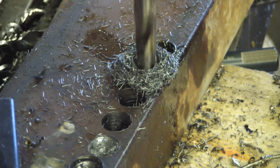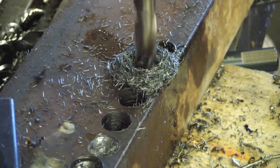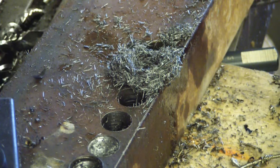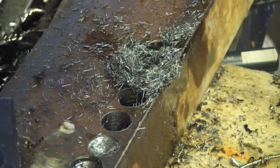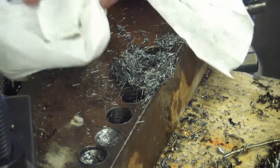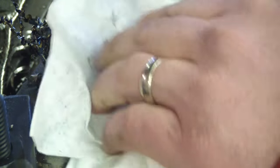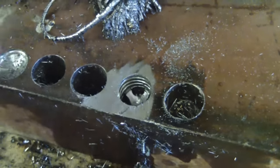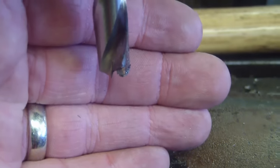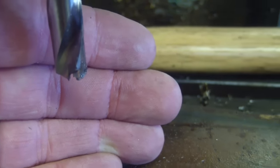As you can see, these chips are already broken. The problem with tungsten carbide is it's really brittle — hard as a coffin nail, but brittle. So it's not very good at interrupted cuts or shock. There we go — I think we're cooked on that one. We actually drilled out quite a lot of it, but what happened was some of those chowdery flute bits got in there and broke off and bound up the bit. There's the bit — she has obviously drilled her last. That's the way it goes. Sometimes you're the lucky one and sometimes you're not.